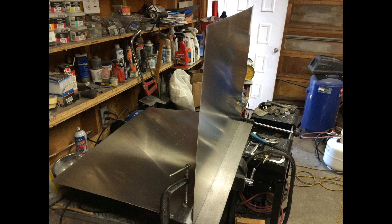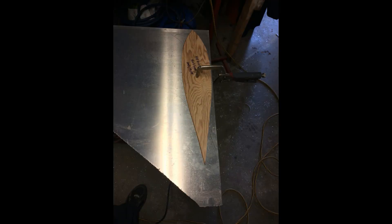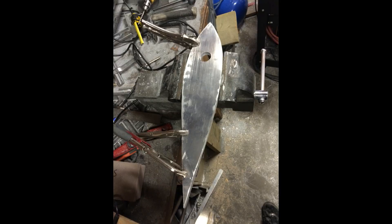So I had to cut the sheets into two by four feet lengths and then using the brake I folded it basically to 90 degrees. The 90-degree bend forms the leading edge of the rudder, and from there I was able to bend it by hand — it was pretty easy to turn it into an aerofoil type shape. From there I cut out some plywood templates recreating that aerofoil shape and used that as a template to cut out pieces from the aluminum plate.